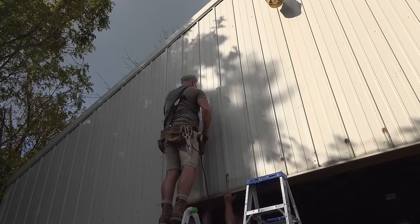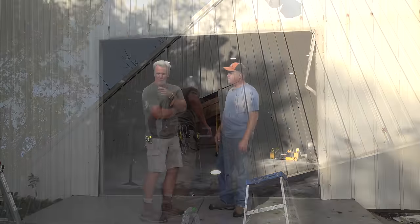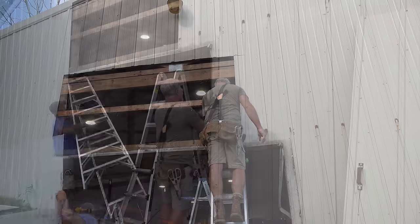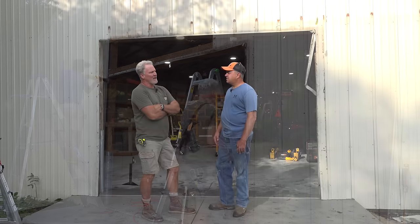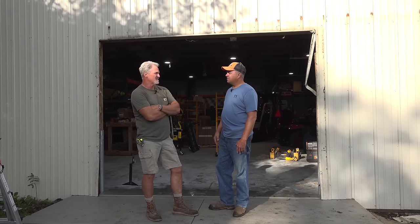This is a relatively small door panel, so you're talking about $3,200 for this door panel in an aluminum I-beam extruded aluminum door — like what Morton has on big openings. On new pole barns you're looking at a 40-foot opening, so you've got two 20-foot by 20-foot panels. Aluminum I-beam will hold up in the wind, where a tab-lock style door will not — they'll just bend. There are a lot of them out there that people think will hold up but they won't. You've got to have a pretty good structure on these bigger-size sliders.